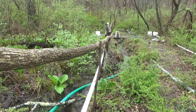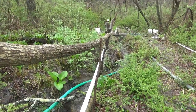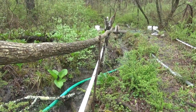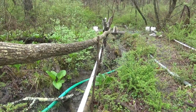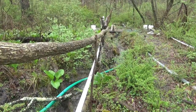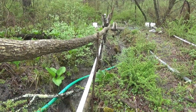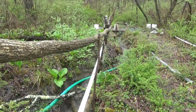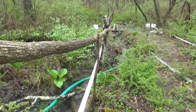From here you can hear the pipe slapping. You can hear that shock wave coming back up the pipe pretty hard. If your pressure chamber isn't saturated, then you don't get that slap all the way back up the pipe. You can see how that much extra energy coming back up puts a lot of wear on the pipe.